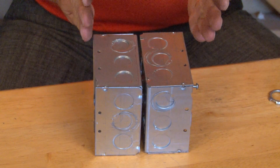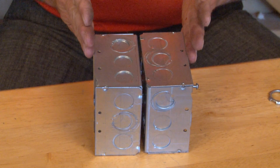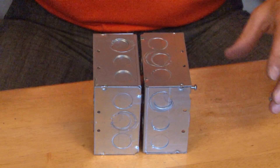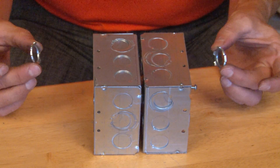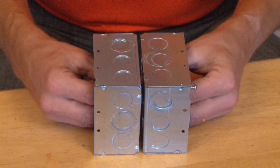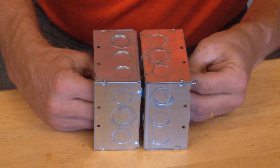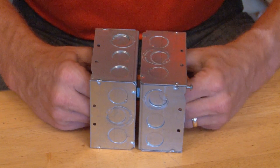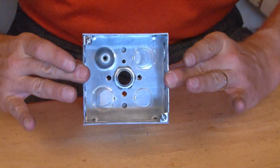At this point, that's exactly the wall thickness you need for wall studs to fit — two 2x4s. You then can take the lock nuts, tighten them on the fitting on the inside, securing the boxes back-to-back and creating a pass-through from one box to the other.